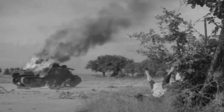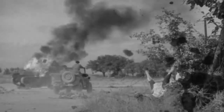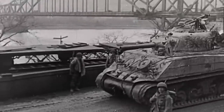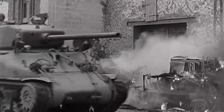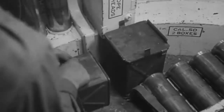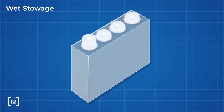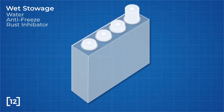In late 1943, changes were made to improve the crew's chances of surviving after a critical hit. The armour angle was reduced to 47 degrees, providing more space to incorporate larger hatches. The majority of ammunition was also moved to the floor of the tank, where it was better armoured and less likely to catch fire. They also implemented wet storage, where each shell was separated by canisters filled with a gel-like substance made of water, antifreeze and a rust inhibitor. If the ammo rack was hit, these containers would be pierced, releasing the gel, which would cool and quench the rounds.